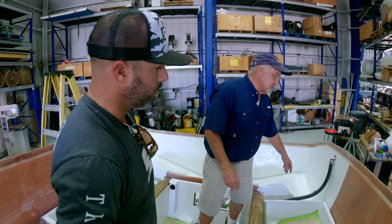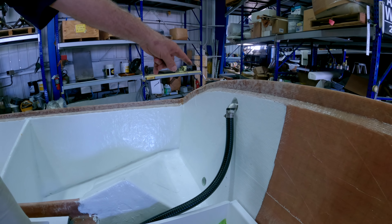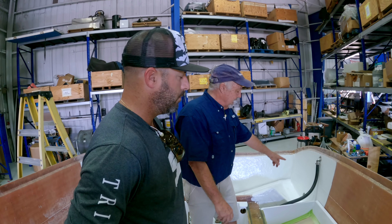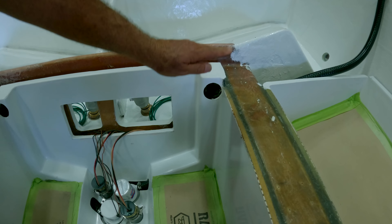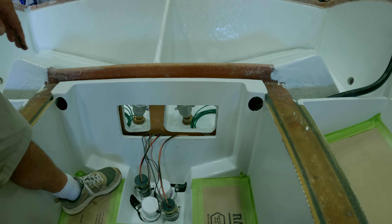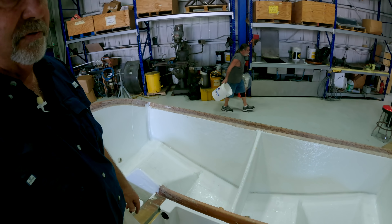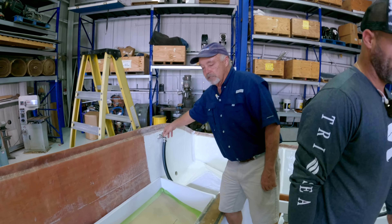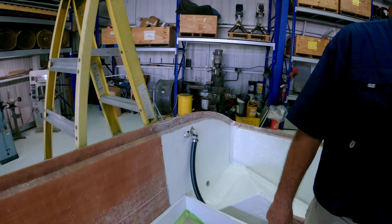The fittings are a little bit more expensive, but I don't like fittings where the hose comes straight off and has to make a bend. So we pay a little extra to get a 90-degree stainless steel through-hull fitting in the back of the boat. Anything that has any kind of pressure, we always cut the core out — we've already ground the core out and mounted it right to solid fiberglass. Much less chance of it ever coming loose. That hose is completely hidden with no tie wraps, so if you have to replace it, you undo one end and it pulls right out. We made a little pocket that the hose hides underneath, so when you look in the bilge it's crystal clean. We add a single transom knee right in the middle, and those two pockets on both sides are trim tab pockets — they'll fit K-planes, Zipwakes, or Lencos, whatever you'd prefer. On the side of the boat, the dark spot is solid fiberglass, the green is foam coring, and then there's more fiberglass on the inside. It was designed to be simple. The vent on this side is for the holding tank. On the water tank, we vent it inside the boat because it's just water — no need to cut a hole through the outside.